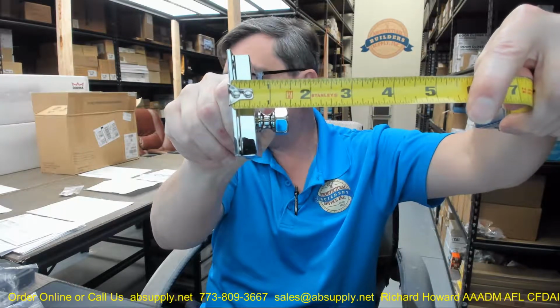It's going to have an overall projection of about 1/2 inch, looking at the drawing, of the body. Projection to the outside of the knob is going to be about 1 3/8. They give you the location of the knob as well. It's not light. This item, at least with its little box, weighs 0.73 pound, so it's substantial. The strike is slightly magnetic as well. So is the box. So is the cover. Ever so slightly magnetic as well. I'm certainly wondering if the plating is what's imparting that magnetism, because this is definitely made of solid brass. There's no doubt about that.